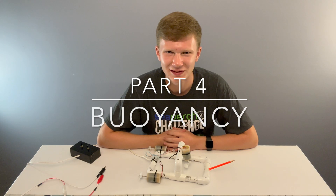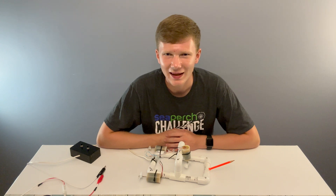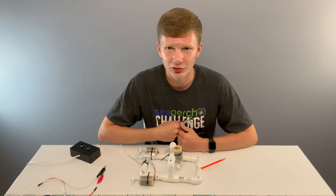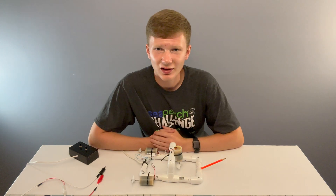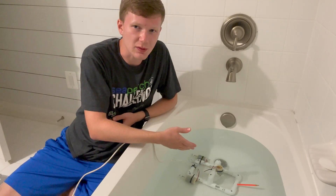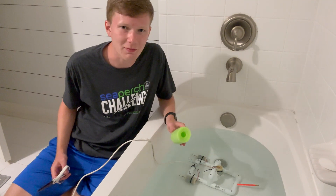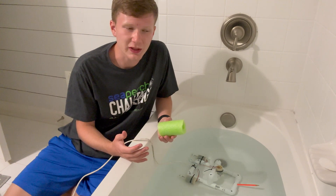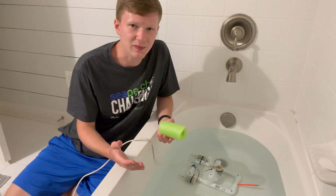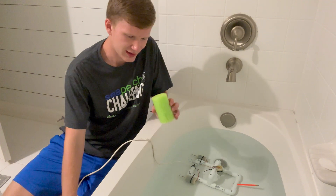Time to hit the waves! We need to figure out the correct buoyancy for your ROV. Now that it's completed, the weight of your ROV is set. You're going to need your ROV and your pool noodles or other means of flotation at a body of water, along with some scissors and zip ties. Before you add any flotation, you can see that the ROV sinks when you put it in the water. What you want to do with your flotation is make it so the ROV is neutrally buoyant — meaning it doesn't float or sink. You want this because when completing challenges you're making very precise maneuvers, and subtle unwanted up and down movements are not going to help. If you're using pool noodles, use scissors to cut a slit along the top.